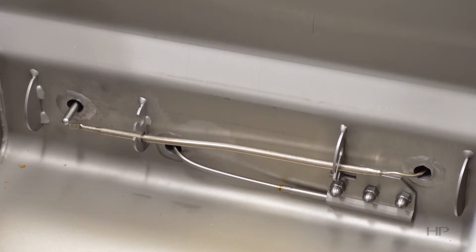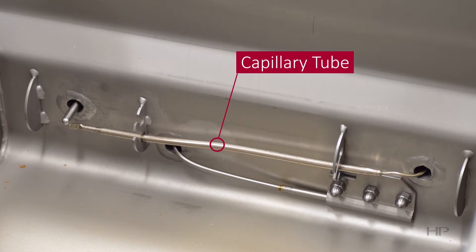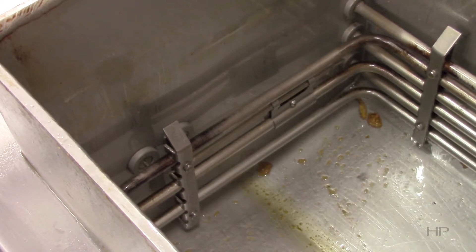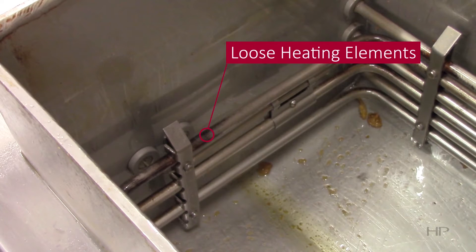However, from an operational point of view the two most common reasons for it are: one, the bulb or capillary tube is compromised due to damage caused by a basket or brush, or due to loose heating elements collapsing on it; and two, the lack of cleaning causes buildup around the bulb, which causes the high limit to overheat from direct heat transfer from the heating elements.